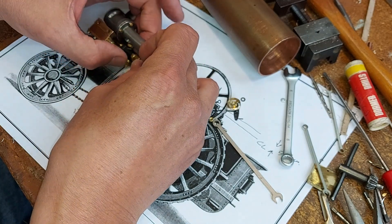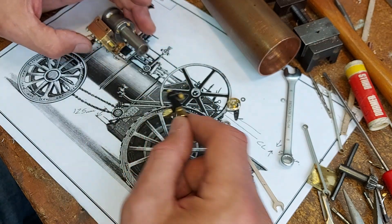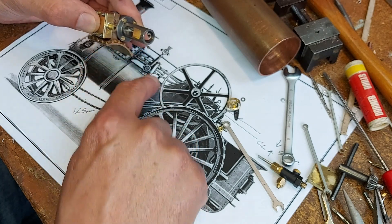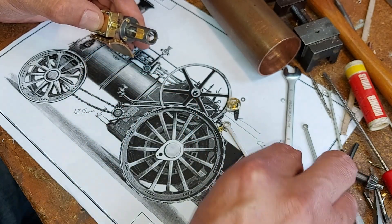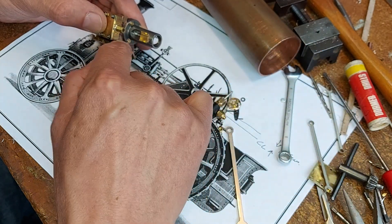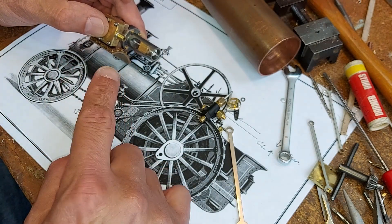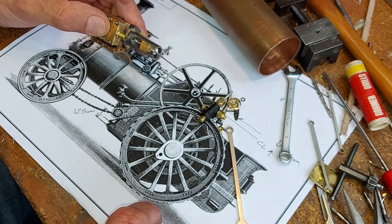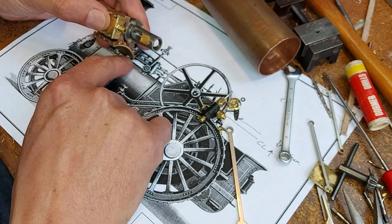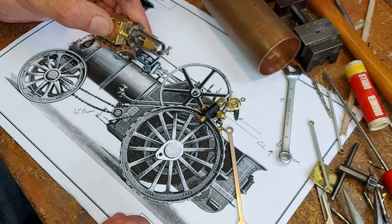So I'd have an extension that comes back and allows me to operate it from the cabin — that's quite an interesting approach. The other way would be to run a tiny pipe from here back along the top of the boiler to the valve in the cockpit area, and then back up to the valve chest. I'd double wrap them in tubing to insulate them and minimise losses — they could be very neatly clipped onto the top of the boiler.